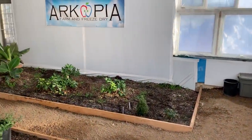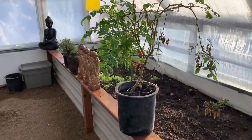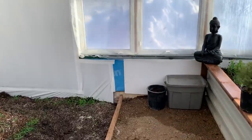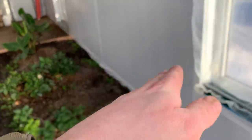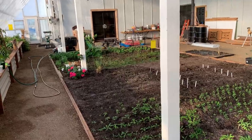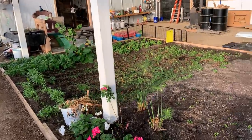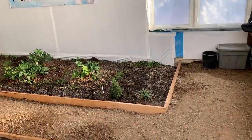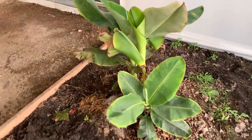The whole exterior of the building — all under here — there is a trench I dug four feet deep, 16 inches wide, packed full of rigid insulation to protect from the frost. On the outside of the building, I also dig down and put rigid insulation at an angle to protect that frost from coming in as well. So this entire area inside is just a massive heat sink protected from the elements outside, the frost creeping in. There's no climate battery system with air tubes underneath — I decided not to do that because of the cost and I don't think it works as well where I'm at.